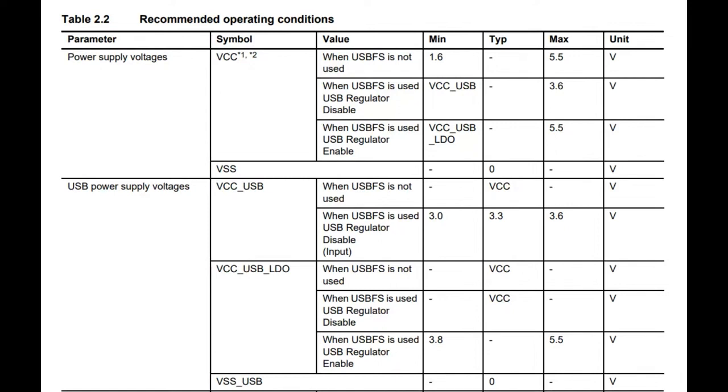The biggest thing is that this chip is 5-volt compliant — and I don't mean like some STM chips where you can run at 3.3 volts and pipe 5 volts into one of the IO pins. You can really drive this whole thing at 5.5 volts max, 5 volts nominal. That's quite unusual because pretty much every ARM Cortex chip we've seen has been 3 volts. Microchip makes the SAMC21, which is 5-volt compatible, but doesn't have native USB — so this kind of has the best of both worlds.